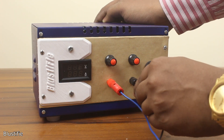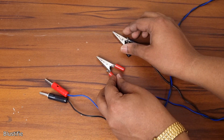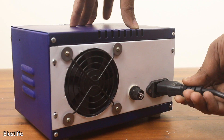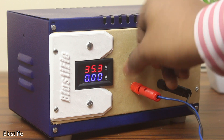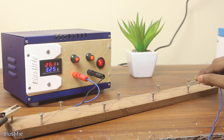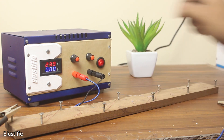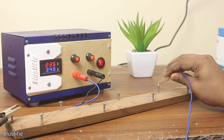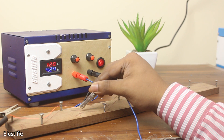After assembling, we can use banana plugs to connect the output terminals with the binding posts. I made this wire with two banana plugs and two crocodile clips. Let's test the capabilities of the power supply. I connected the AC power cord and made a load with nichrome wire, cranking up all the potentiometers to the maximum. It's clear the voltage isn't maintaining at 35V — it drops to 26V at a current draw of 2.7A. By increasing the load by reducing the resistance, at 24V we can achieve up to 3.5A. If we crank down the voltage to 24V, it still maintains 3.5A. At 12V, the power supply can deliver 4.5A — pretty good for a beginner.